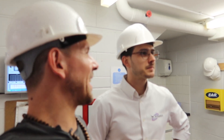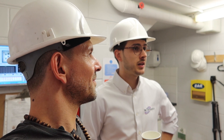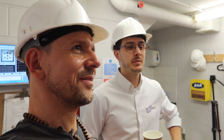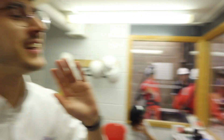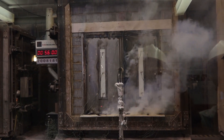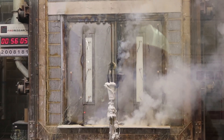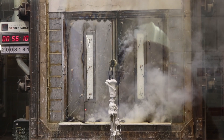That's why it takes people like IAC Acoustics to build them. And it isolates 50dB of acoustic isolation. So this will be the first in our new acoustic doors to come out — the name is to be announced. If it's boring it's good. If there are flames everywhere it's very bad — exciting but very bad. If you take a look at the specimen at the moment, you can see all around the tops and sides of the door it's blackening and it looks like there are drips. All of that is parts of the interior of the door — different parts burning away and dripping down, moisture being released and dripping down. And it's what we want to see — it's a good sign that everything inside is doing the job it's meant to do.